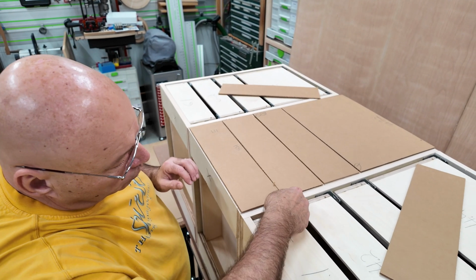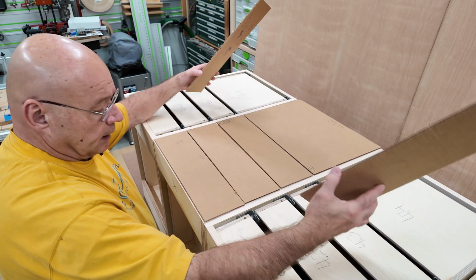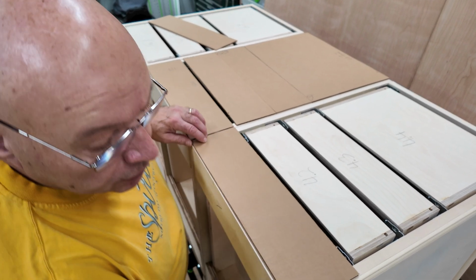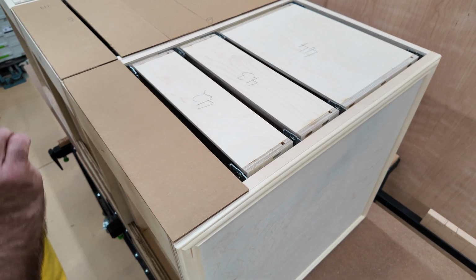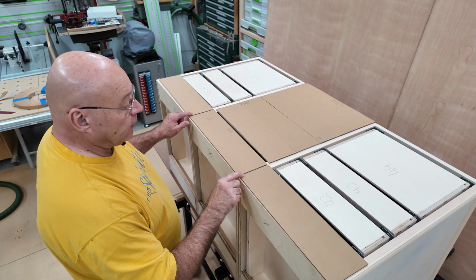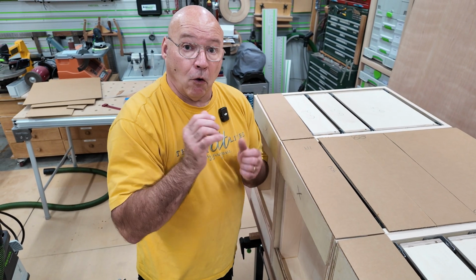What I also did is laid out those 2mm lines on the corresponding cabinets. I brought everything up here. You can do this in place. But I ripped 2 more of those 120s, okay? And I brought it in just to make sure my math was correct, and I bring it to my 2mm lines. Look at that. It's all laying out just right. Oh, that's gonna work out perfect because look at my applied molding that we did in that former video. I'm gonna come in here and just remember, I don't have these screwed together yet, but this will all work out absolutely perfect. And yes, I know that's a 4mm reveal between the cabinets. So when we're finished, this will look like a continuous piece of cherry, hopefully.